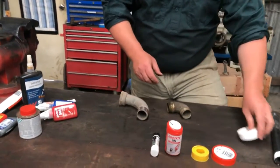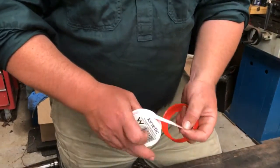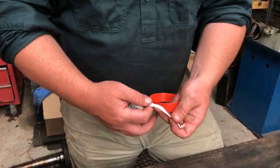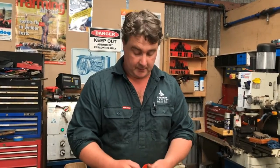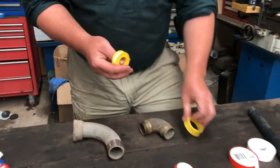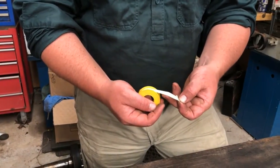There are a few different types of tape. The pink tape is not a bad one to go for — that's kind of an industrial tape, very thick, and it's for water. So don't confuse that for another material; it's a Teflon tape for water. The yellow stuff, however, is suitable for gas and LPG, so that's the stuff to use on your gas fittings.